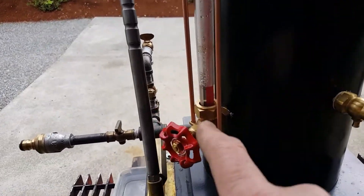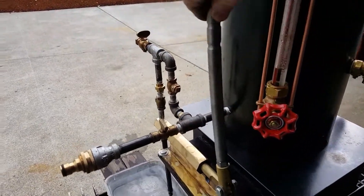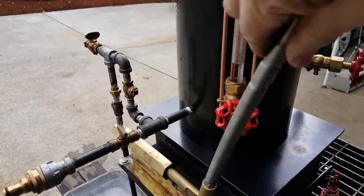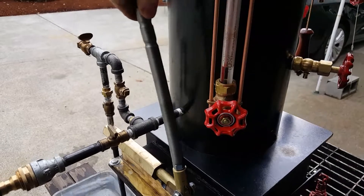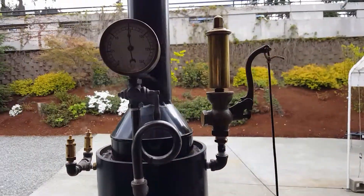Water is a little low in it. I can just start pumping it — maybe 80 to 100 times and it'll bring it right up there. Of course that's bumping cold water into the hot boiler so you're going to lose some of your steam pressure, although right now it's about 75.